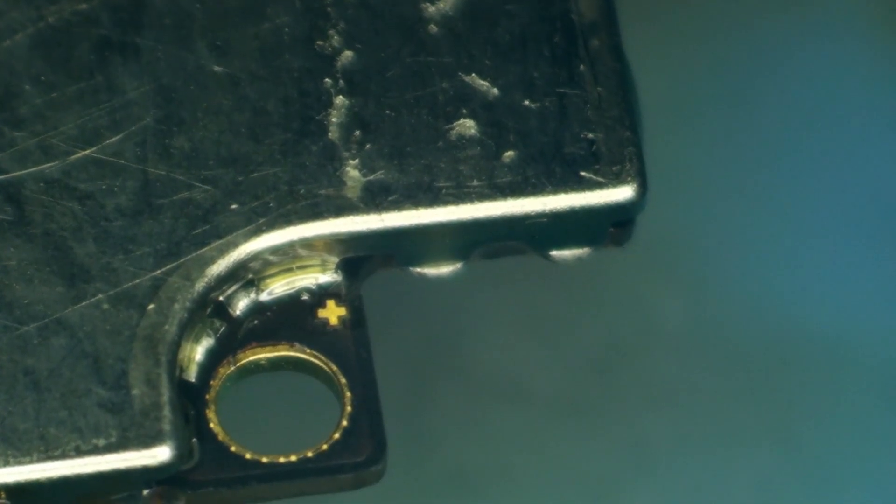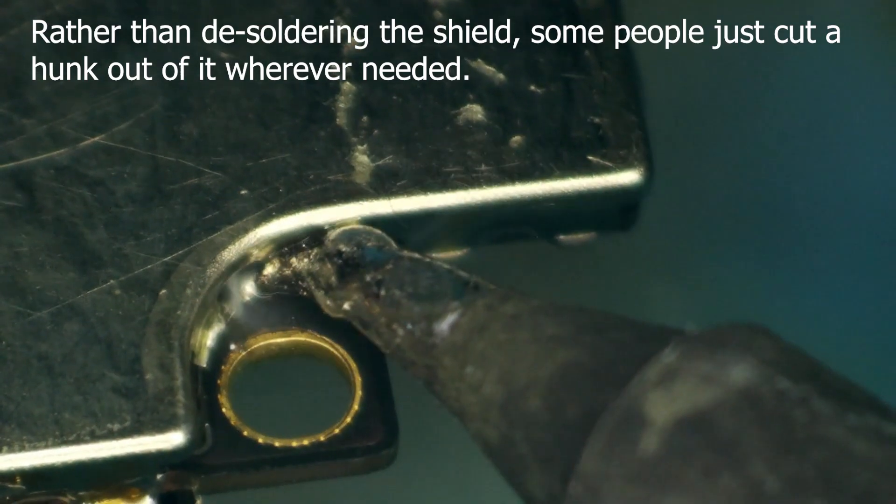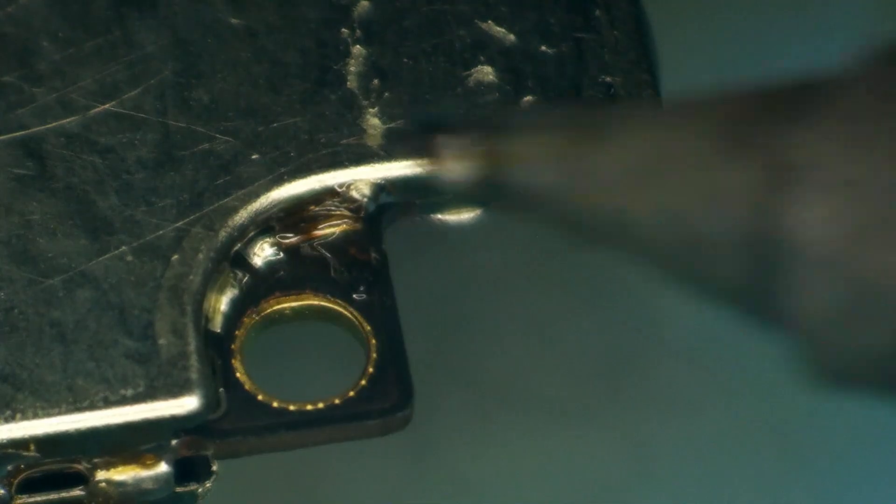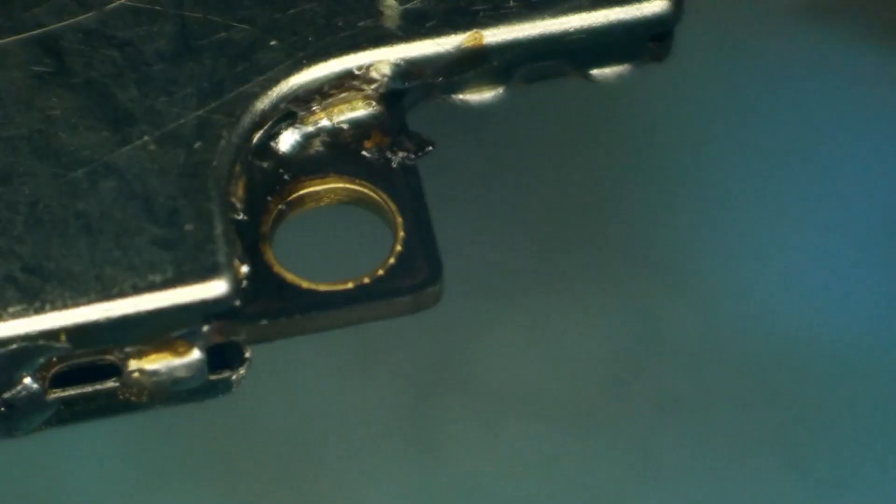I had just finished telling Paul Daniels that from now on I will be cutting the iPhone XRs, but in all my years of doing this I'm just not comfortable mutilating these boards. So let's say one more — I'm going to do one more the hard way, the nerve-wracking way, because it really is nerve-wracking. Get this thing just a little too hot and suddenly your one-hour job just turned into a two to three-hour job.